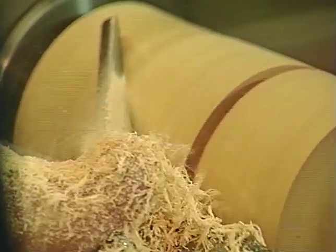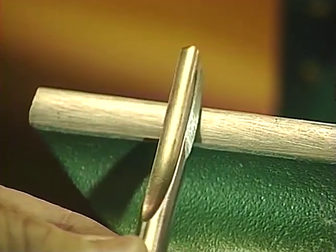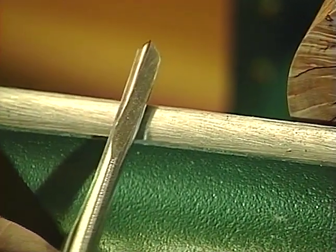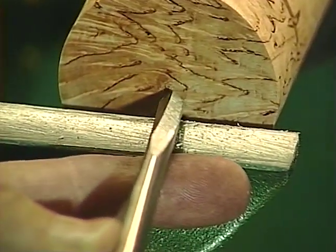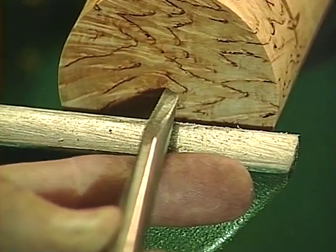I use it very much like a chisel, like a skew, on the outside of the boxes to get a good clean surface. With a very short obtuse bevel, it's ground down the side wall, and this will be used to hollow the whole of the interior out. That side wall is only really clearance. It doesn't help in anything you're doing in the hollowing of this box.